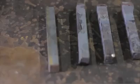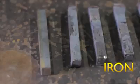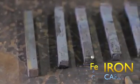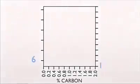So what exactly is happening to this block of steel as it is being heated to such extreme temperatures? Well, steel is an alloy consisting primarily of the elements iron and a small ratio of carbon. As you let the steel heat up, carbon begins precipitating away from it. Generally, steel has about 2% or less carbon content. Although minute, carbon has a great impact on the crystal structure.